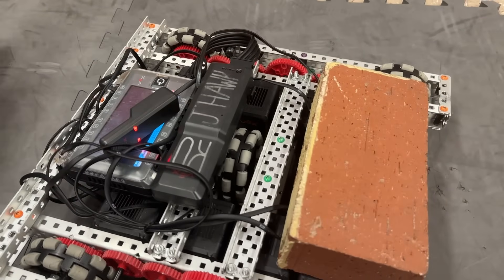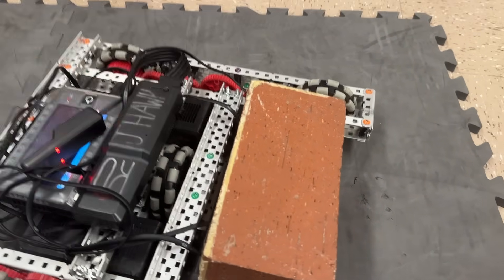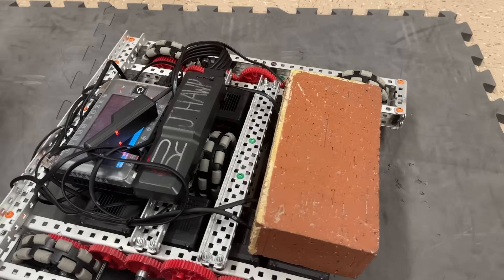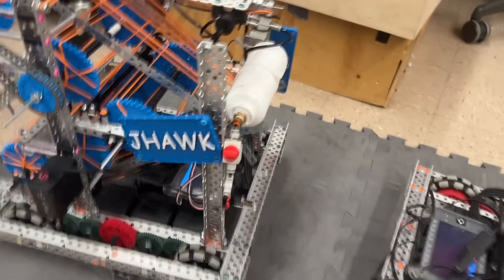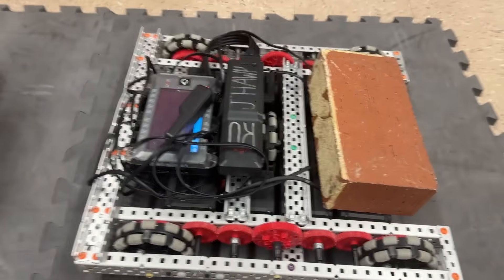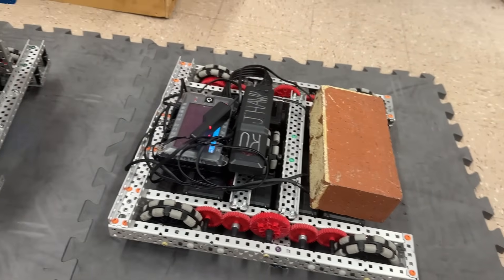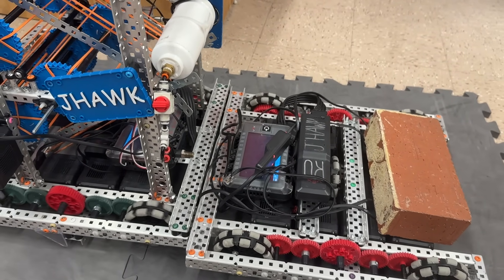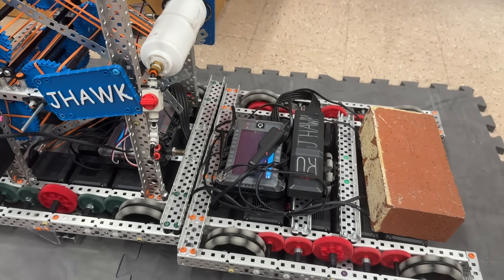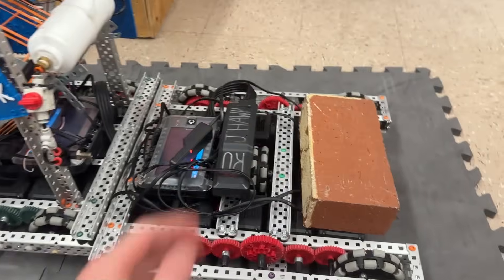You could probably have some sort of tensioner so it had even tension with the ground, but that sounds like a lot of extra work for what it's worth. It's kind of hard to justify H-drive. Here's the Jayhawk 15 for comparison — this wheel does not really take away traction. I'm going to put them in a pushing match against each other. When they both drive backwards, nobody's really winning that pushing match — so it's not like the H-drive wheel hurts the forward/backward pushing ability.